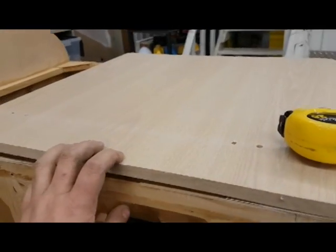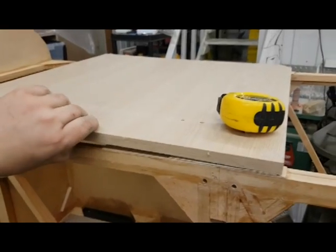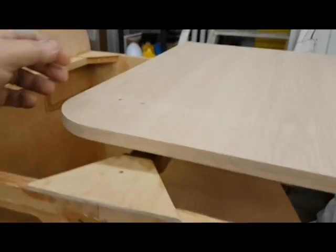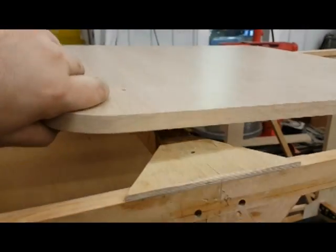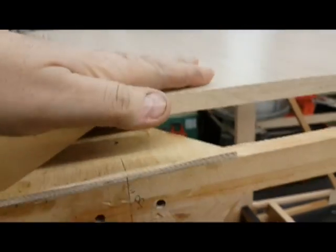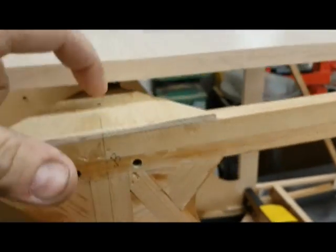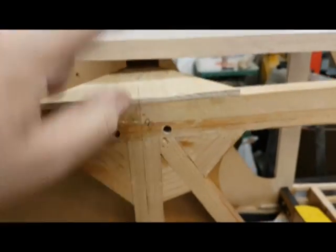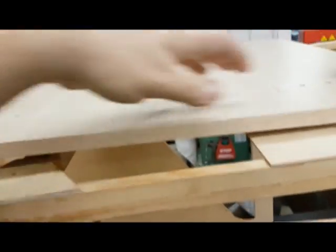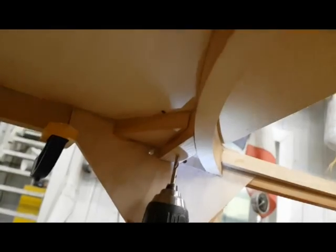This is the start of the jig for the cabane — just a piece of wood that will encapsulate all four holes. I'm going to make two holes here for this holding device of the gas tank so it can fit flat, clamp it, make sure it's flush, and I'll transfer all these marks here so I'll be able to bolt my metal fittings and carry on. So far so good.